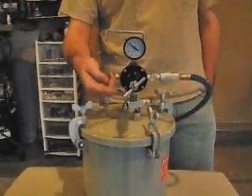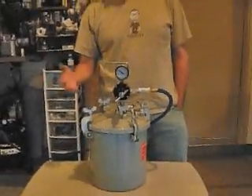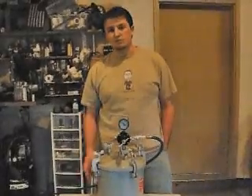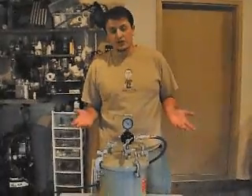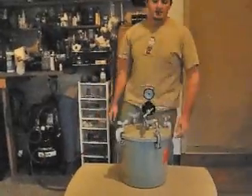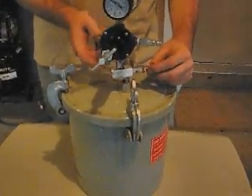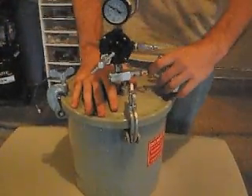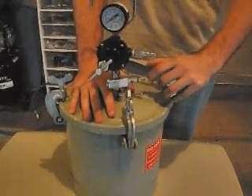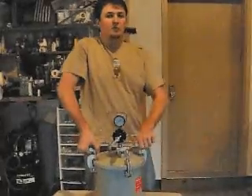You can actually hear this tank has a little bit of a leak right from here. I would usually fix this sort of thing, but the leak is good for me because it releases pressure slowly. Usually what I do when I make a mold is put the thing in here and leave it overnight, and by the time I come out the tank will be at zero psi, meaning it hasn't undergone any drastic pressure changes. When you come back, you don't even have to pull the pin out. To empty the tank, you just disconnect it. This is the blowout pin — when pressure gets too high, this pin gets forced out enough to release air. You can also just pull on it to release pressure in the tank. Then you hear all the pressure come out and it's back at zero — at that point you can crank it back open and remove your finished part.